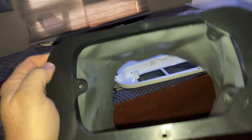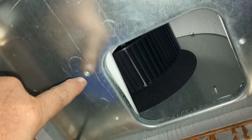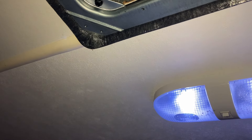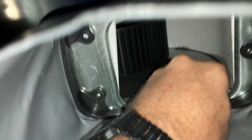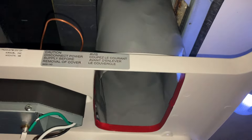Next on the list is the ducting. You're going to take three of your screws that come in your kit and put them here, here, and here — they're already pre-punched and tapped for you. You're going to take the ducting that has the two holes on this side and match it up to those two. So we're going to grab these screws, get the ducting on there. This is what's going to be facing up, and your ducting is what we're putting on the inside of this.